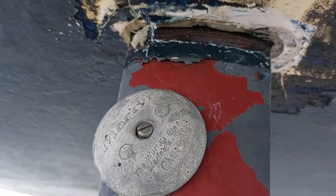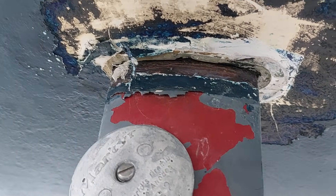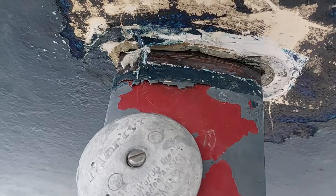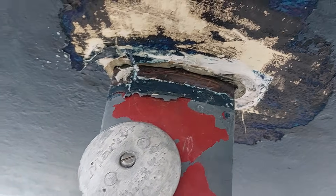Another day in the life of surveying, which always makes it interesting. But this is a classic example of what happens when you get a rope around your prop under load. So do go and have a look and make sure you have a proper look. And while I talk about it, don't forget where the load goes to — so the prop got wrapped, the shaft has been overloaded, the engine mounts, gearbox, and pressure plate all need a proper check.